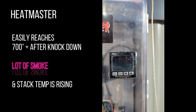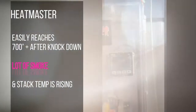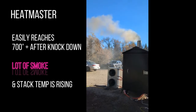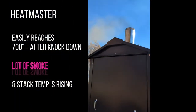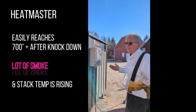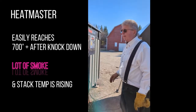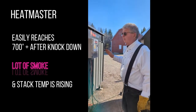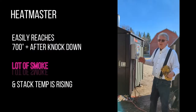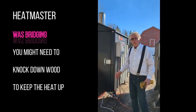It's cycled twice in the last 45 minutes compared to the Heat Master, which has just been running continuously. We want to talk about the knockdown that we just did and why we had to do that. Normally a guy puts wood in maybe after supper - say six or seven o'clock, fills his boiler for the night. What we're finding is that if we didn't do that knockdown it couldn't maintain temperature; it was actually losing temperature, or just holding - it wouldn't reach the set point - and so it was delivering cooler water to the radiators.